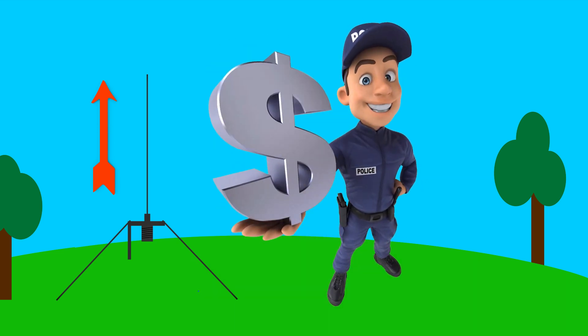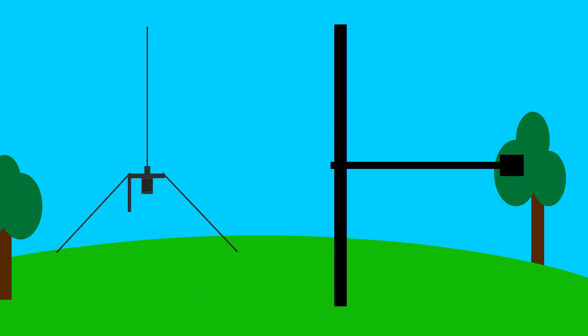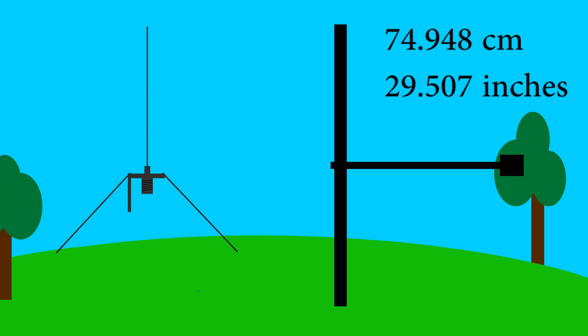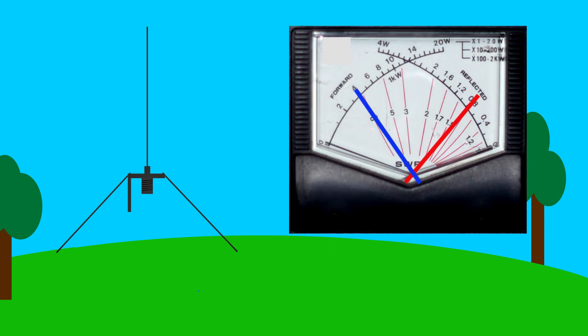All antennas you buy must be adjustable and readjustable. Once you have calculated the quarter wavelength of your transmitter frequency — for example, 100 MHz gives 74.948 cm or 29.507 inches — adjust the length of the radiator from the base to the tip for a quarter wave, and from the center to the ends on a dipole to match that length. For a half-wave dipole, you need to do this for both the top radiator and the bottom ground plane to be the exact same length. For a quarter wave, you only need to adjust the top radiator. You can adjust the ground planes, but it will make little difference and very rarely are these ground planes variable in length. This is the first step, which should give you quite a big difference on your meter, but it is not the last step.